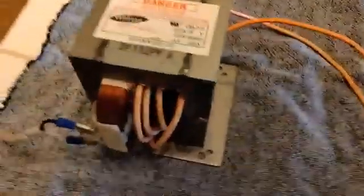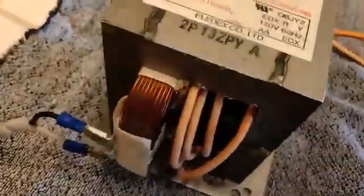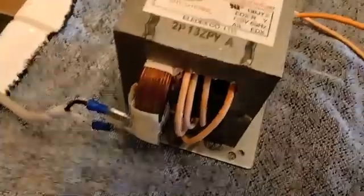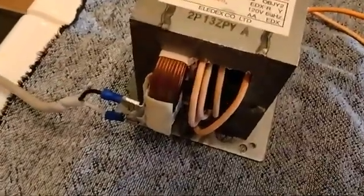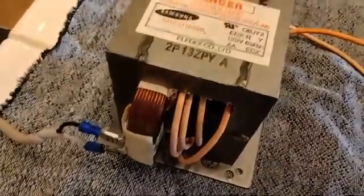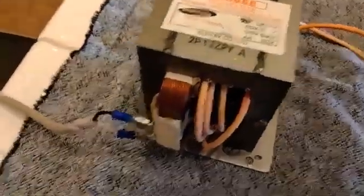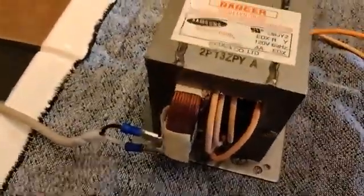What I'm going to do now is fix this transformer. With this thing humming and drawing over 10 amps, that primary winding is going to get hot — this whole transformer is going to get super hot. Putting a power factor correction capacitor on it, or a fan, or anything else is just asinine. This thing is drawing almost 11 amps to light a filament. It's going to get hot and it's going to cause trouble.